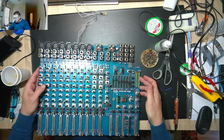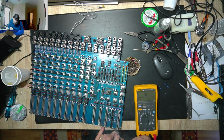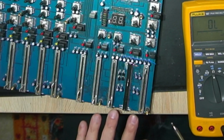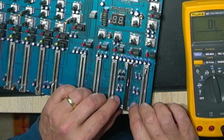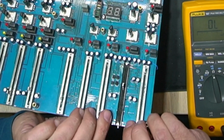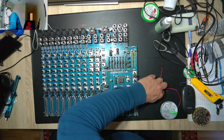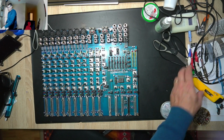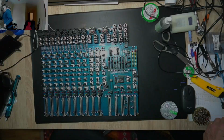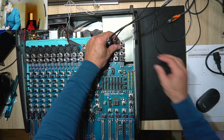Alright. By the schematic, the end of the resistance, which is 10 kilo ohms, has to go to the ground. So these two are going to the ground, and the other ones will be the signal. Doesn't really bother me. The most important thing is to see things running. I can't wait for spare parts. I need this up and running as soon as possible. So that's why I'm in a kind of hurry. Output, 2 channels. There you go.